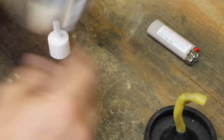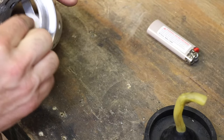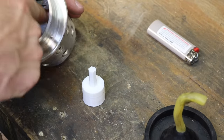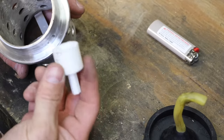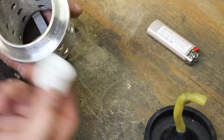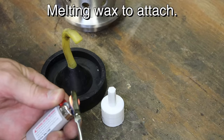Now this is a little small, and this barely has enough room from the midline. So the idea would be that you pour down the center and you fill your patterns around the periphery. You don't want to pour directly into the pattern. But, you know, I'm going to rig it up and do the best I can. This isn't that complex of a part and should work fine.